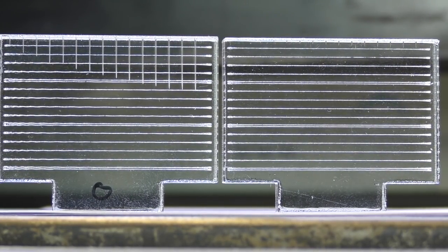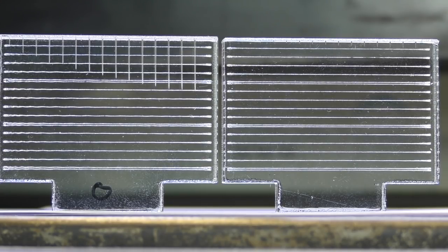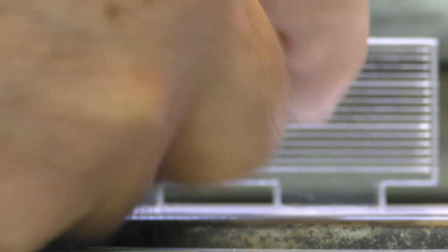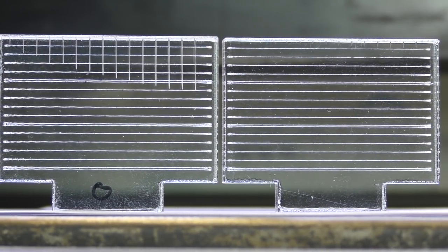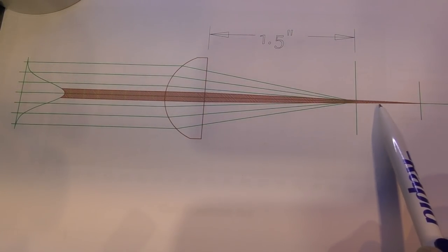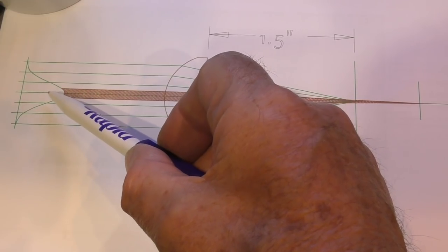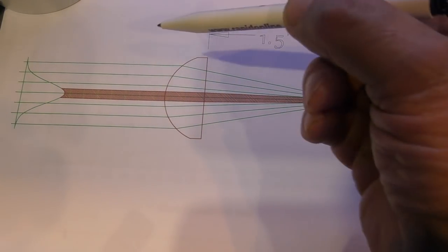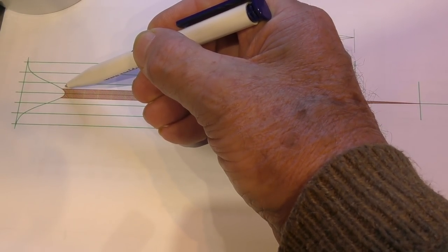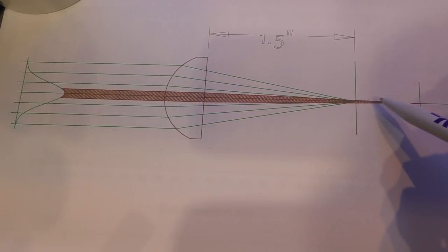When I remove the center, you can just see about 2 millimeters of penetration as opposed to 14 or 15 millimeters of penetration with the full lens. I think that's pretty reasonable proof that something significant is happening right through the central axis of that lens which is causing cutting — because if I remove the central axis I basically destroy the lens's ability to cut. On the other hand, when I try to engrave with this lens it engraved perfectly, so I've only destroyed one of the lens's properties.